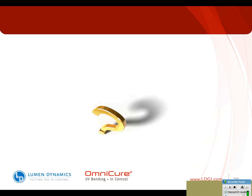Well, anytime very high precision is required, we find that's where customers seem to be most interested in closed loop feedback technology. A lot of our customers that manufacture catheters use the closed loop feedback technology. Also, you find it in highly automated processes, like I mentioned before, like cannula manufacturing or insulin pen manufacturing, where the production rates are very, very high. And there's automation involved. It means that that technology is very well implemented.